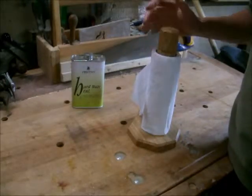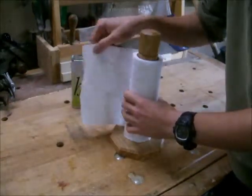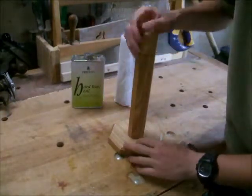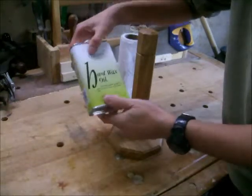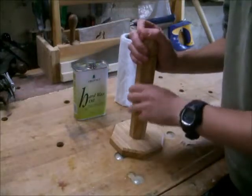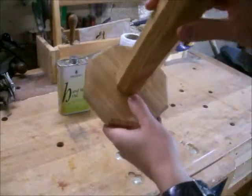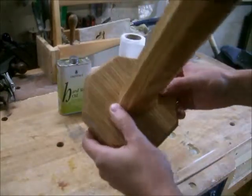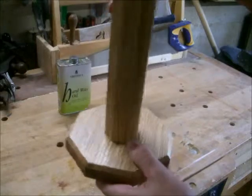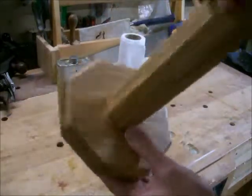It's been a long time since the previous part in this video series, but at long last I can finally say that the towel stand project is complete, as you can see here. The main delay in getting this finished was that I'd run out of the hard wax oil from Chestnut Wood Finishes, or what I did have left wasn't very good — it was a year old and had gone quite thick in the bottom, and I found it wasn't going onto the wood very well. I had some dark staining where the old oil went off, but with a bit of careful work with a chisel and a card scraper, I was just about able to remove most of that.